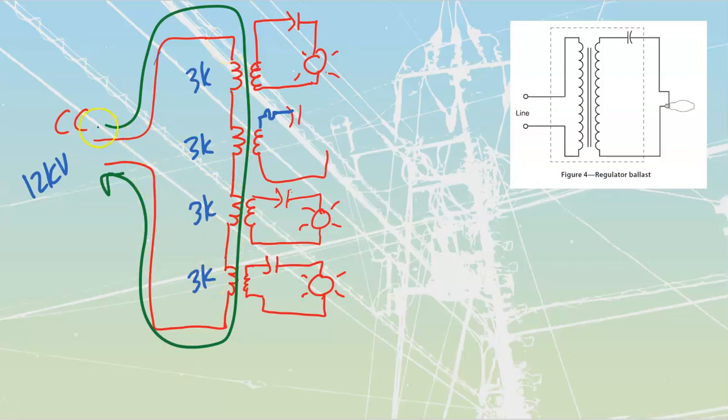That value of voltage is going to be variable as well, because if I lose this, I lose my watts that I would have off of that as well. And we know that VA in is equal to VA out. And really, this is like one big giant transformer with many windings off of it. So if I'm no longer putting out these watts, I'm no longer going to be putting out these watts over here on my input over here.